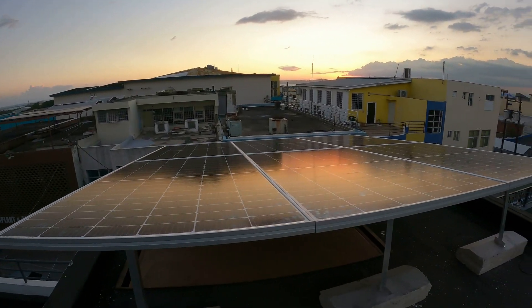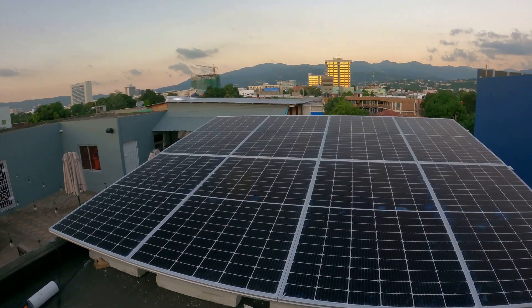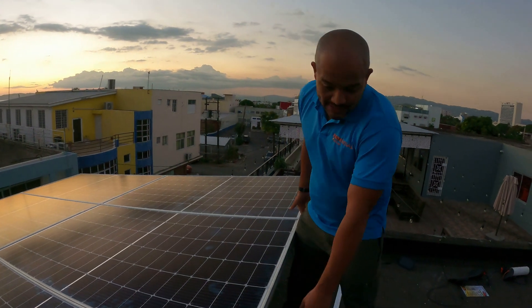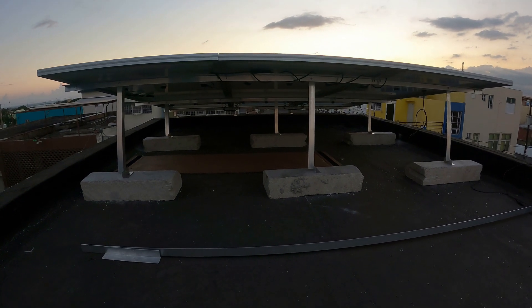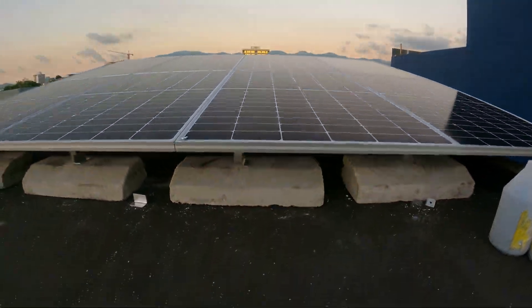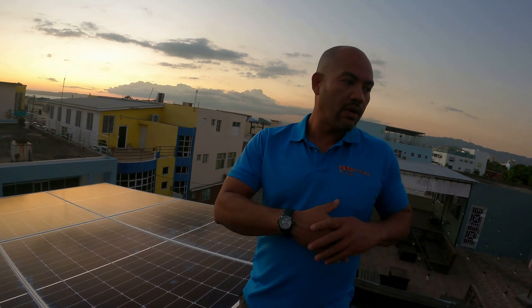Family, day three — looks like the last day. This work started Friday afternoon, and if you've been following the videos you know we couldn't finish Saturday. The panels have been put down a long time and the men are wired up now. I want to mention something about the panels: people often ask us about hurricanes. We bolt them so heavy that literally the hurricane would have to be strong enough to break the actual panel before it can lift them. It would take probably a strong category four or five to even challenge these panels. They're all bolted, so there's no question of them being attached to the building properly — that's the standard we hope to set here in the Caribbean.